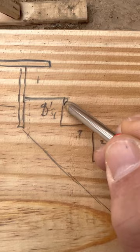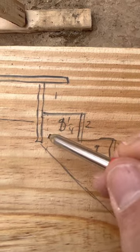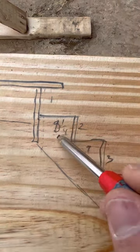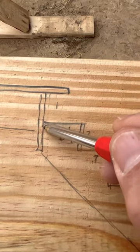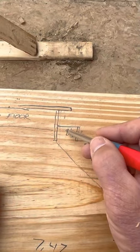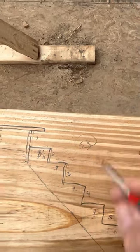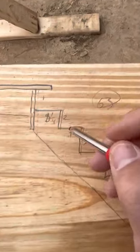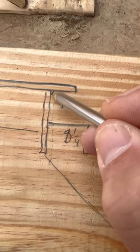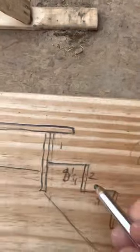And then once you put your first riser on, it goes back to 9 when you're installing it to here, if this was 8 1/4. So if you're not gonna put a second 1x over top of your 3/4 board, then you wanna use this method. You wanna use 8 1/4. If you're planning on putting a 3/4 board on here, then you need to consider that in your number. It's gonna be 63 3/4. If you're cutting this down because you're not planning on putting a 3/4 board on here, then your number's gonna be 63. And that's actually what we're doing on this particular job, because I know they're not gonna put another 1x on here. In fact, if they want it to be a finished staircase, a lot of times they'll just use a thin laminate, like a piece of 1/8 inch, one side sanded, and it doesn't really account for much. It's not worth considering in your measurements.